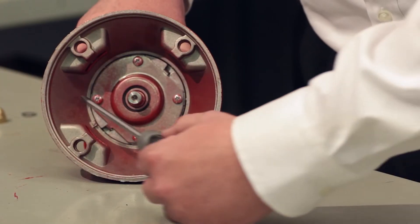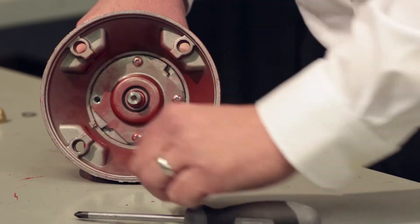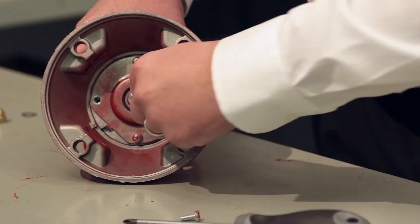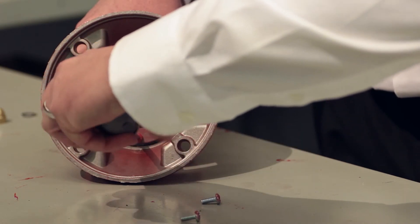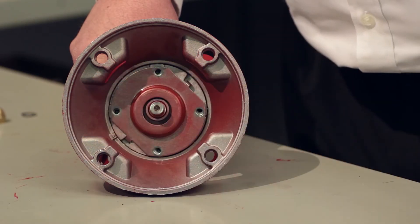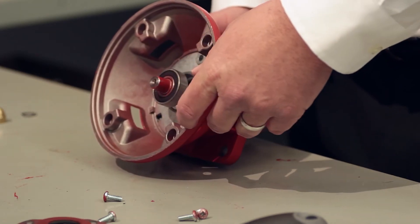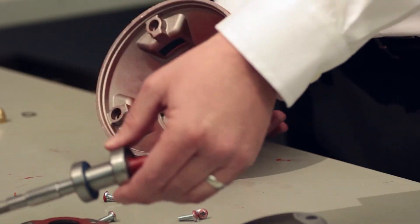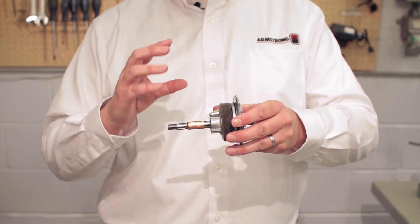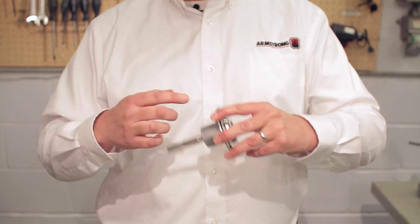I want to show you how easy it is to get the bearing module out of the bearing assembly — it's literally four Phillips-head screws. When you reassemble this, you may want to use some anti-seize just to avoid damaging the assembly. After removing the last screw, take the backing plate off and push the assembly through — you may have to tap it with a mallet, but it comes out very simply. Typically when you remove a bearing module, you'll be removing a sleeve-type bearing that requires lubrication. However, you have the option to upgrade to the maintenance-free version, which has permanently lubricated ball bearings.